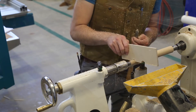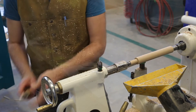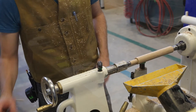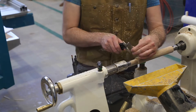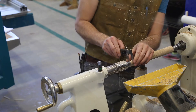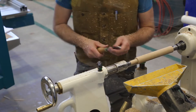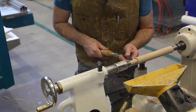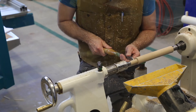So I'm going to check it one more time, and it's looking pretty good. So I'm going to turn the machine off. That template tells me I'm pretty close to my final size. I'm going to check with a digital set of calipers and just see how close we are to three-quarters of an inch. We've still got a little ways to go. And just like with any joinery, I'm just going to creep up on this fit.